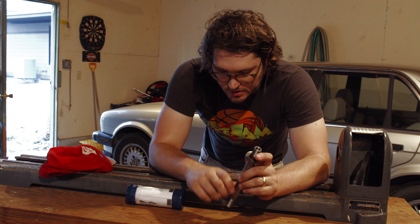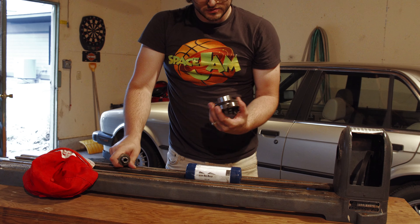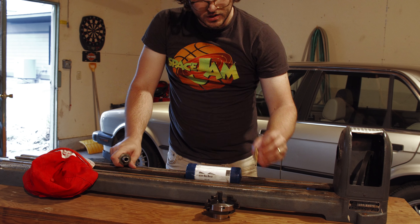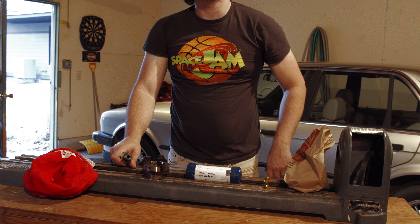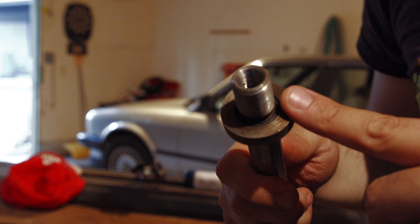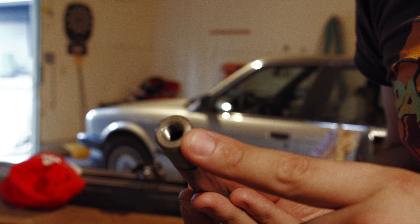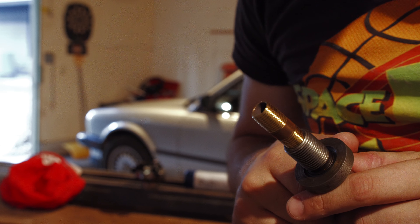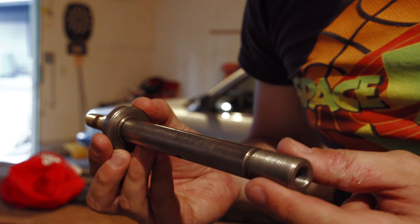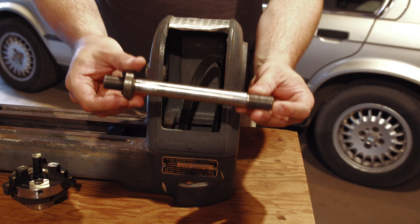I have my rotary coupling, got my lathe, I have my three-jaw chuck, and I've got some fittings. I just got some more fittings because we're ready to go. That's a lathe spindle with some threads inside it - quarter inch NPT threads on this end, and it's a little narrow on this end, eighth inch. We need to be able to pass air through this. I've got some teflon tape and some other stuff - we're gonna see if we can fit this up. I think we should do a dry fit first.